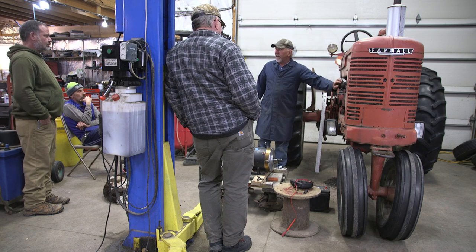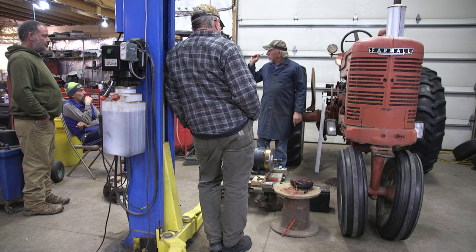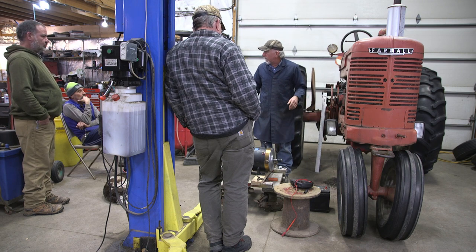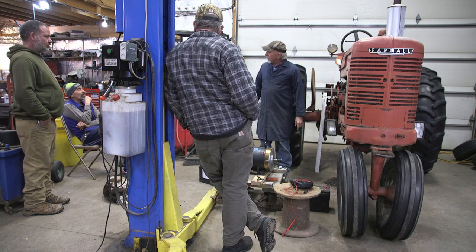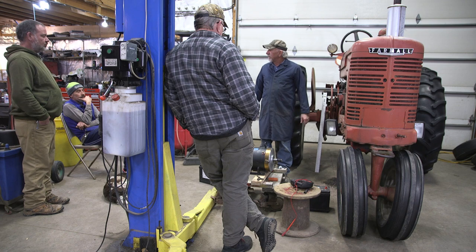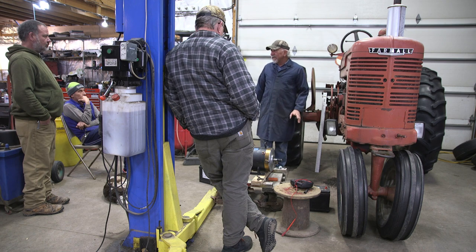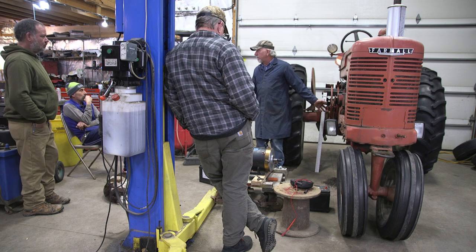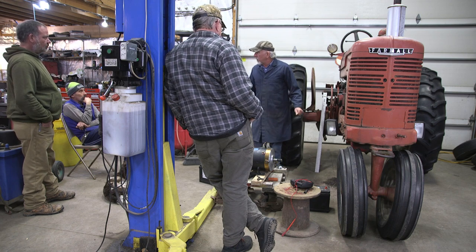Now this engine's going to be off, but I still need to run the power steering and I still need to run the three-point. I was going through auxiliary pump options — belt, chain, all of that. Then I realized: I'm going to put that belly pump back together again, because it is live when the transmission is turning. There are a few little rubs on this thing, but I won't have much at low speed and will be kind of limited on the RPM of the pump.